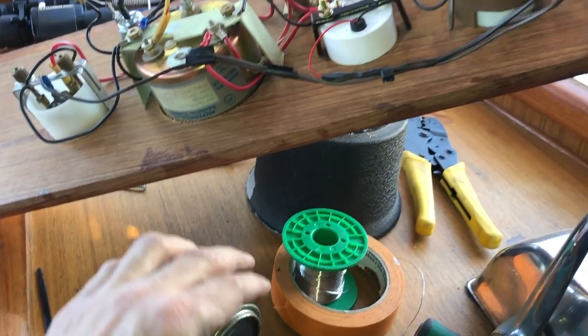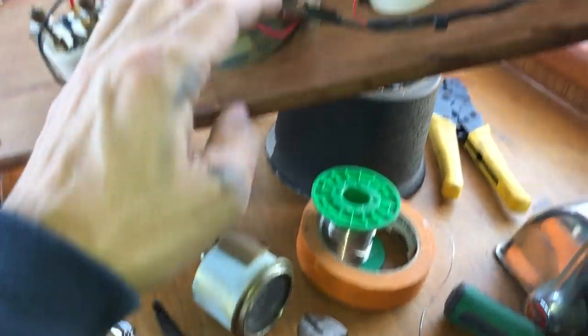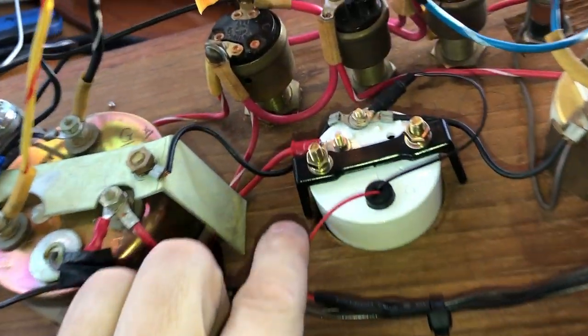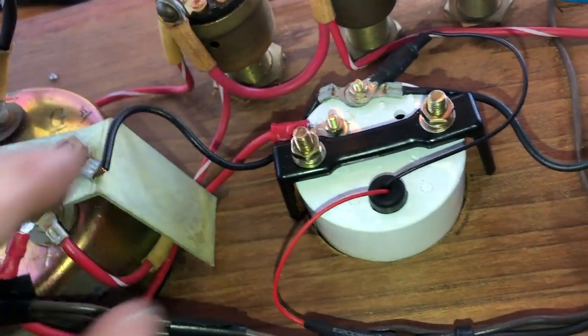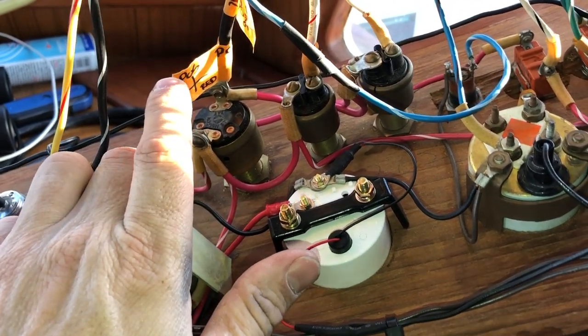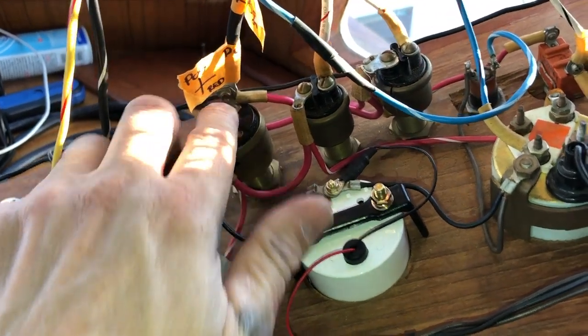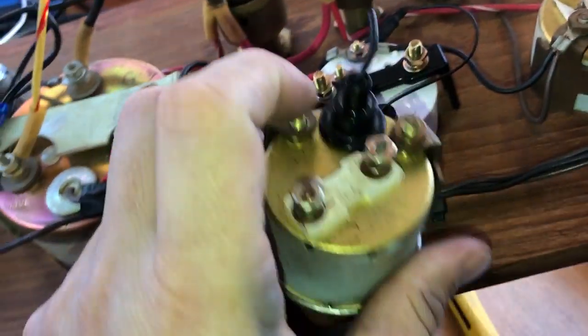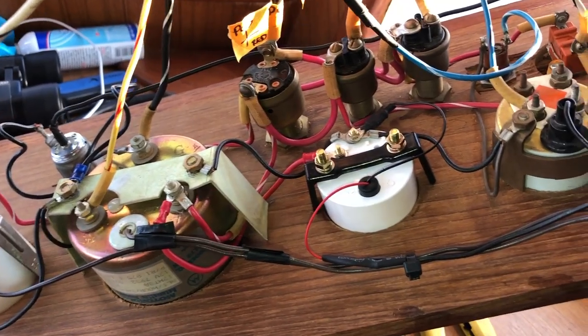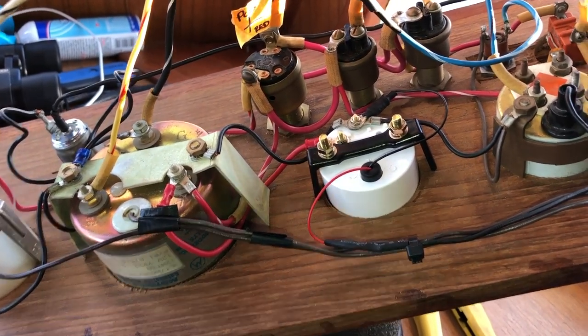What I don't understand is why, in the middle between the two amp meters, they chose to use a black wire? Because this terrifies me. Now that I've bypassed the amp meter, I have a voltmeter in place and I'm powering the voltmeter off of the gauge ignition switch. So the gauges aren't on unless the ignition's on. But originally the ignition battery side was powered off the black cable side of this amp meter. Are you confused? Because I'm confusing myself just trying to explain this. However, I feel pretty good about all of it.